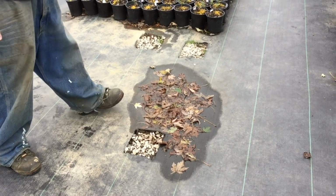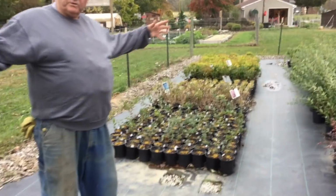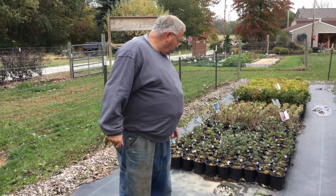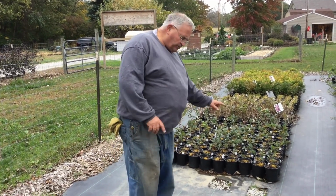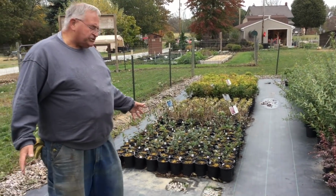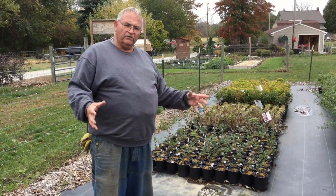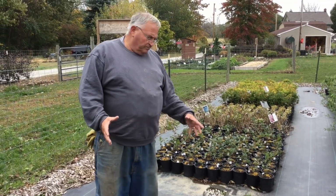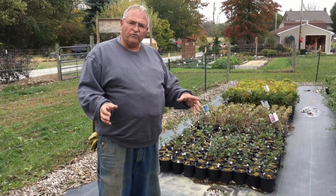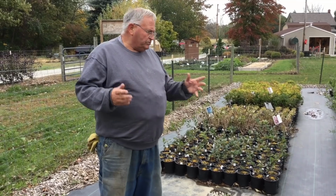You may get a little tiny puddle like this or that one down there, but we don't have puddles that are 2 or 3 inches deep and cover a dozen or 20, 30, 40, 50 square feet. So in this area, I put 1, 2, 3, there's one there, and I see one down on the end. So it's actually a pretty simple way to get rid of a pretty big puddle in the middle when you don't know what to do with it. Just dig a hole, go down, the bigger the hole the better, but I made mine about 6 or 8 inches in diameter, down about 24 inches with the post hole digger, and simply filled it with that washed stone.